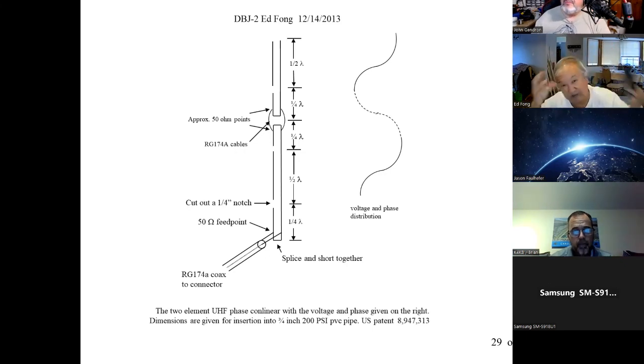It's in a nice case. But the reason why you have to calibrate a network analyzer is because you have to consider the coax length. If you're going to measure the S parameters, you've got to calibrate out the coax. That's why in a spectrum analyzer you don't have that situation. You're just looking at a signal. You're not trying to measure the impedance, you're just trying to measure the strength of the signal. Gotcha. That's why you don't need calibration in a spectrum analyzer.